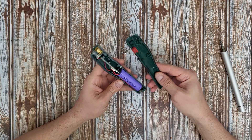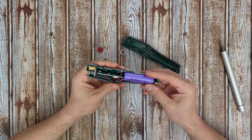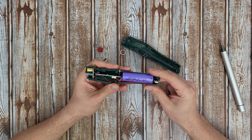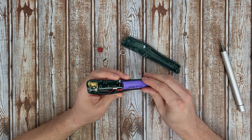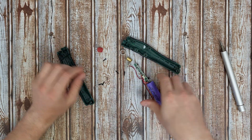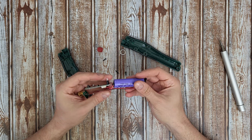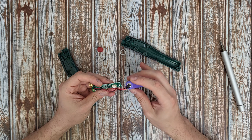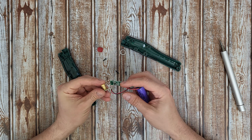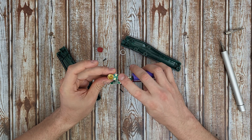And there it is. We have this soft rubber button and inside we can see one lithium cell — 1500 mAh, 3.6 volt, Parkside 18650 battery. We can remove all that very easily. We've got this plastic piece for the working light, a Type-C port, and from the Type-C board one cable goes to the main board. Two cables from the positive go to the front where you can screw the tip, and there are two LED working lights.